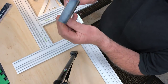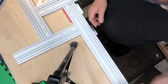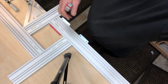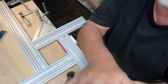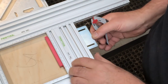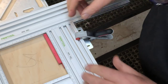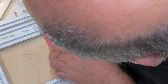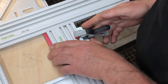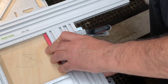Down here I've got the little brackets at the bottom. They've got a little right angle and you can slide them in the track - up and down and back and forth. I've pushed them in so they sit snug against the rail. I clamp this down temporarily, make sure I've got my 9mm - I can tap it up a little bit - and now I've got my 9mm. I push this in so it's hard up against the fence, then use a hexagonal screw underneath to tighten it up.